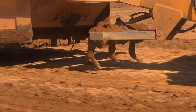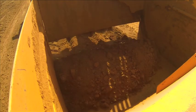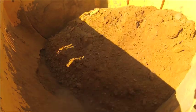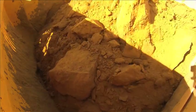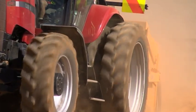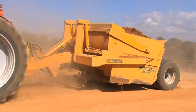All Maxi Scrapers can be fitted with Maxi rippers to help break up hard clay and turf, to stop it rolling up inside the bowl and to allow the material to spread better. The advantage of having the Maxi rippers at the front of the machine is that it allows you to see what depth you're ripping at, and for pre-ripping the surface before placing material back — like metal to tracks and topsoil to contoured land. A set of Maxi rippers will help you key the soil or metal into the base material.